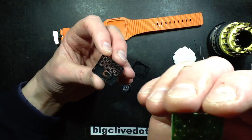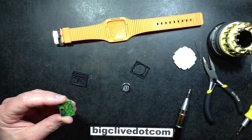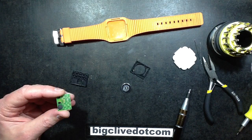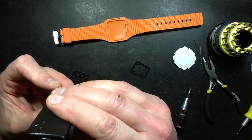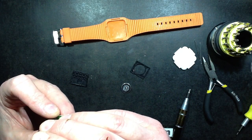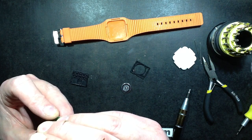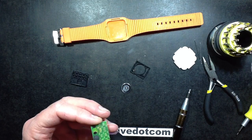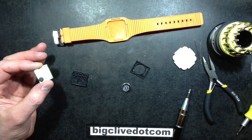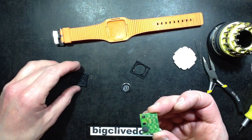I'm tempted to look at this a bit closer with the microscope. I think it's going to be gold wires going straight onto LED chips. So I'm going to hover carefully above here. Yes, it is - they're round pads with the square chips bonded onto them, and then the gold wire jumping directly across, so it's all exposed. If you rub the front of this board it would almost certainly dislodge those little gold wires and your watch would be dead - it would lose segments straight away.